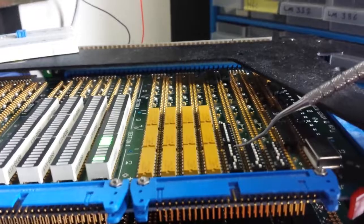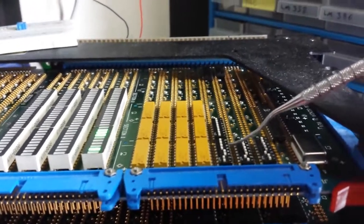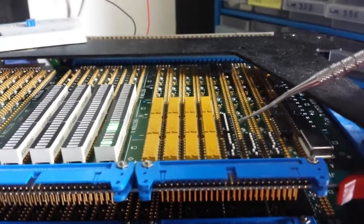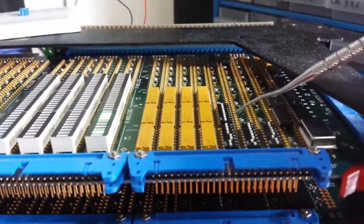The rest of the buttons include, for example, a DMA request button to put the CPU into a hold state where it releases all the buses for use by another device, and then there are more buttons for other functions.